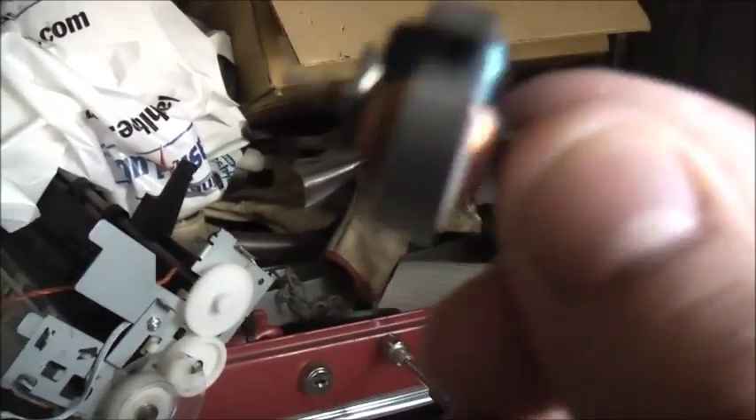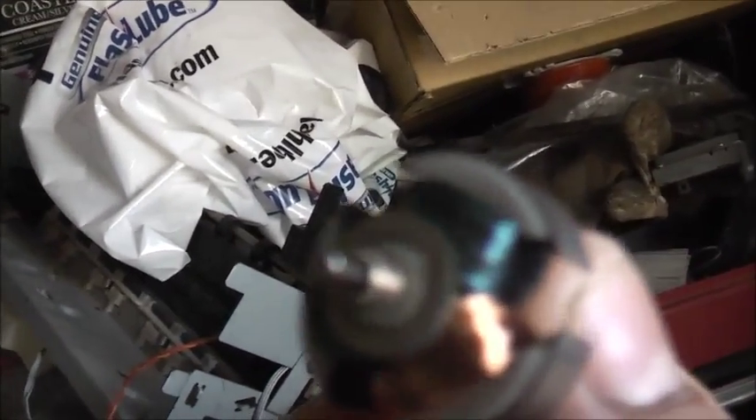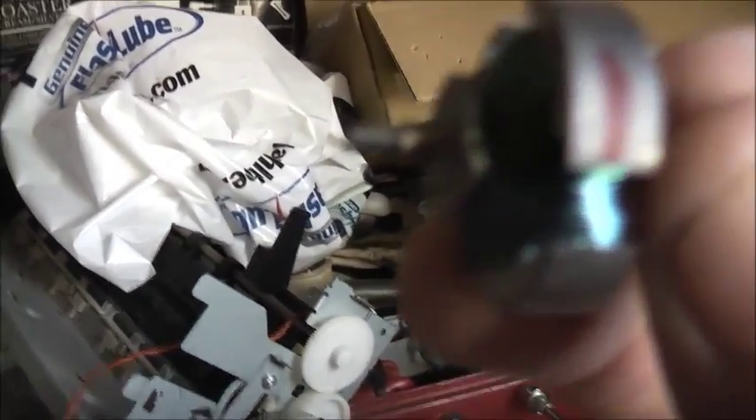Upon testing it on the battery, they shorted out directly across and melted. Whoops. Here's the original commutator — all that brushed metal fragment, bloody powder all over them. Carbon from the brushes, and there are big grooves in the commutator.